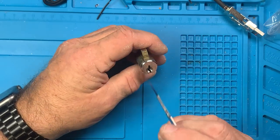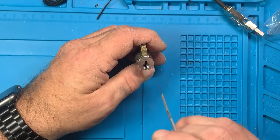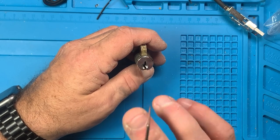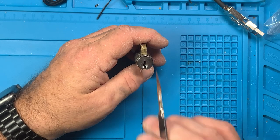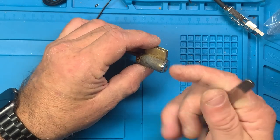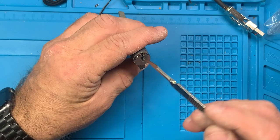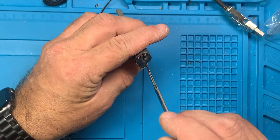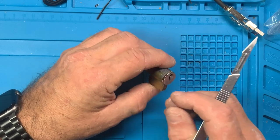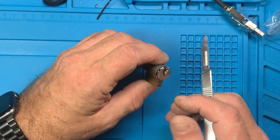In this case right here, you want to install the lock so it's facing just like this in the door — you want to have your base pointed to the ground and your bible pointed straight up. The reason being is all your springs and pins are in here. If you have this pointed down and it's an exterior door, rain can tend to get inside, causing corrosion, and you'll always wind up having to change it out or put lubricant in there.